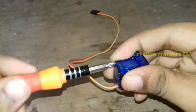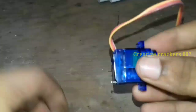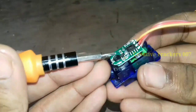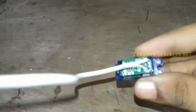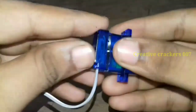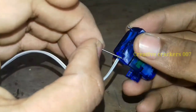Now we are going to turn the servo motor into an ordinary motor. Just unscrew the screws from the servo motor and you can see that there are three wires coming out. Our job is to cut down the three wires and solder two wires at these two points so that you can turn the servo motor into an ordinary motor. It will be no need of any microcontroller or any ICs to control the motor — it's an easy job for us.